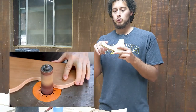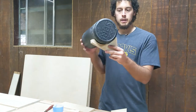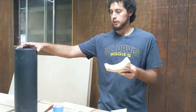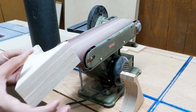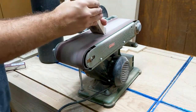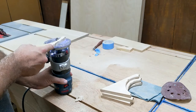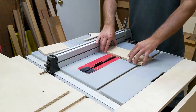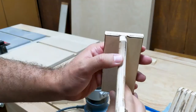So the profiles for these shelves are cut out now. If I had a spindle sander I would take away a little bit of material from here, because I noticed that as my foam roller sits in there it touches the edges before it touches the bottom. But I don't have a spindle sander — I do have a belt sander. I'll use the edge of my belt sander to take a little bit of material off on the sides. I'll do a round over on each of these just to make the edges real soft, do some sanding, and then I'll need to make the back pieces which is just going to be about a 5 inch piece, 3 inches wide, so that I can screw it to the wall.